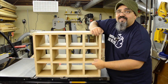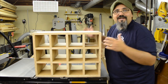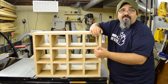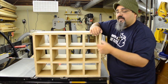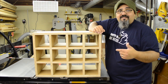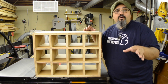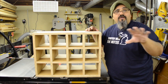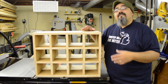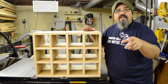I knew I wanted this to be extra rigid — I don't want issues when shoes are being taken in and out, and shaking it, it's not going anywhere. So for the horizontal dividers, I wanted them to fit into quarter-inch deep dados that are the full three-quarter-inch width. That means swapping out the regular 10-inch saw blade for an 8-inch stacked dado set. One notable thing about the SawStop is how you change the brake cartridge for a dado set — and that couldn't be easier. It took me longer to figure out how many blades to stack than to do the actual cartridge removal.